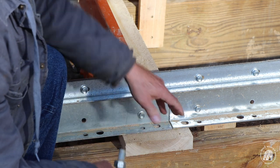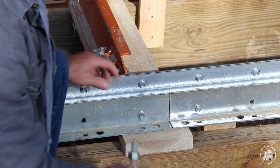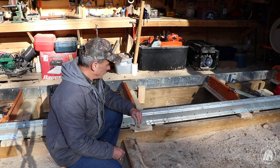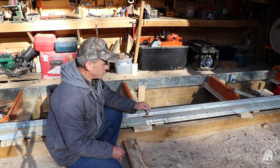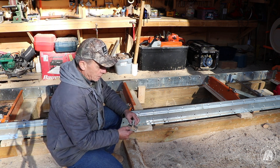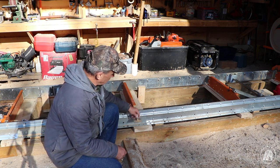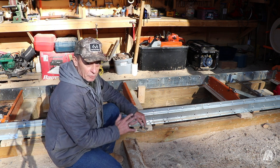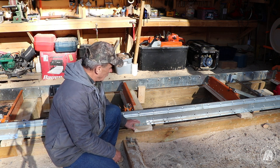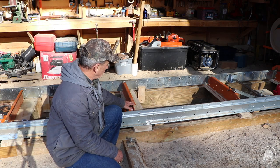Well, when we put the footers in for these 2x12s, not really having put a sawmill together before, we weren't really sure if it needed the feet or not. But every once in a while, as the machine would come down the track and vibrate, the screw might get a little bit turned because it didn't have a lock washer on it, and it might get a little unlevel and you'd have to go back through and level it up again. So I decided to take those off, and I took a 2x6 and went across underneath each bunk.